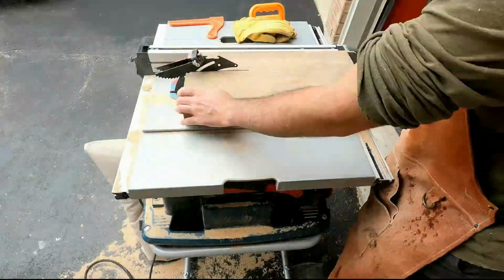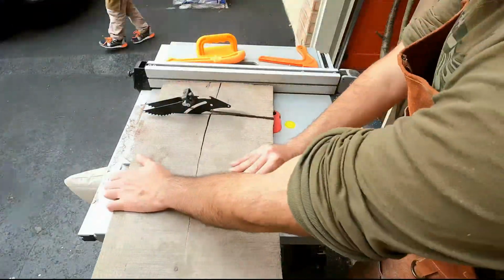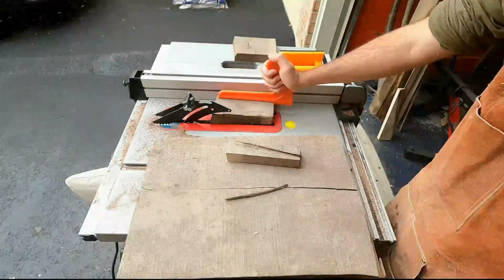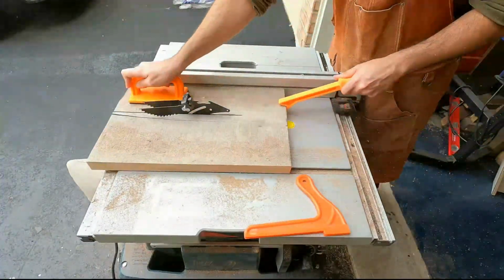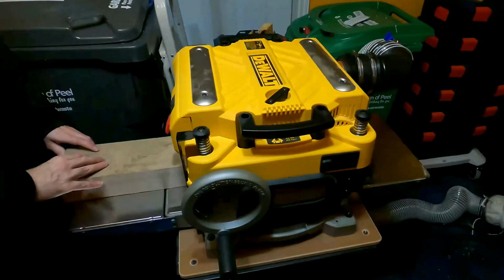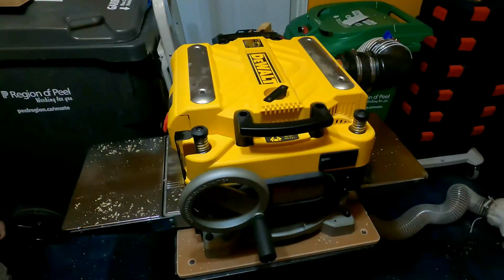For today, I have decided to make a cutting board. I got my hands on a piece of ashwood and walnut and then proceeded to mill it to size. This wood was quite old when I got my hands on it, so it was filled with cracks and lots of insects. Once milled, I decided to run it through the planer to smooth out all the sides of the lumber.